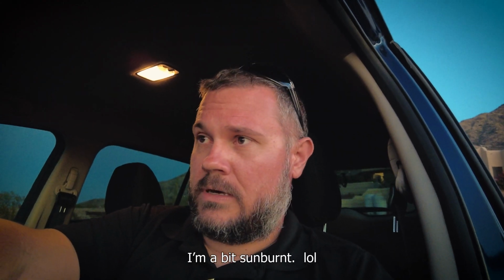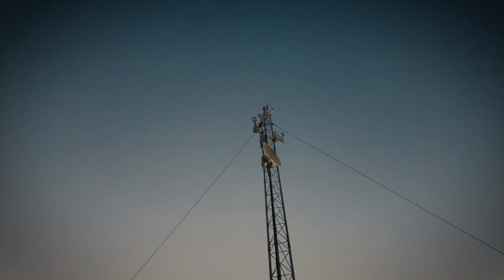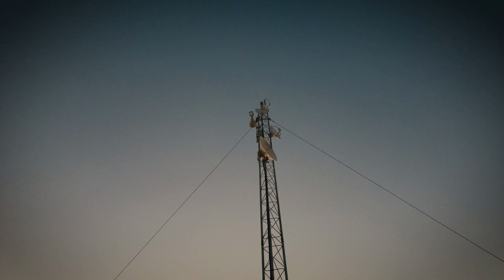I got some IP issues. I went home and was swapping over radios to DHCP, and then it stopped working. So I came here and it's still not working. So John's monkeying around in the switch. He did the initial setup in it, and he's tweaking it, seeing what's going on with it. I don't think the switch is passing traffic, but we're all just kind of in a holding pattern right now. But the 60 is up, and it's passing traffic, and everything should be working well. We just have to sort the IPs first, because I can't get into any of the radios. Once I can get into the radios and switch them all to DHCP, we can set up the router, then we're done.